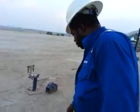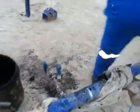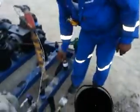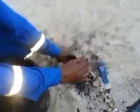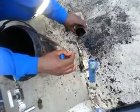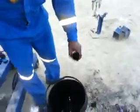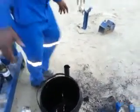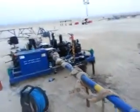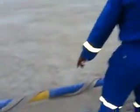Quick on-site analysis — we take sample from here. You can see what I am going to do now. Practically, I want to take a sample from the well. If the well is flowing, I want to take a sample. You can see the sample I am collecting from the well. This is a live well — we are flowing the well, we want to test it. So I am taking the sample of the crude oil. You can see we are taking the sample of the oil. This is our flow line, this is the downstream of the choke manifold. You can see the color has changed from black to yellow and blue.